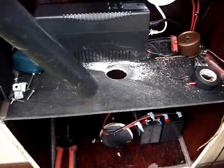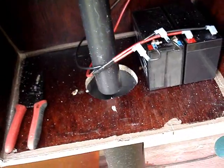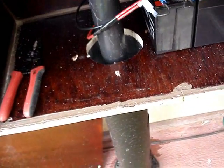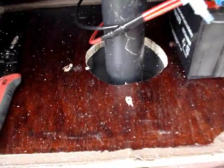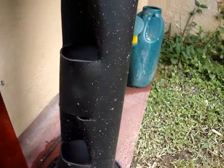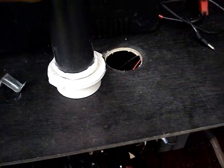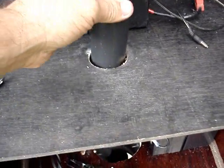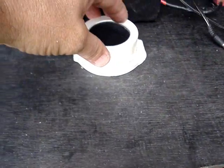I have to get fresh air up to the top portion of this box. The way I do that is I drop a 1.5-inch PVC pipe down through the floor into the top portion of the 4-inch vent pipe in the bottom that holds up the bottom of the box. I do that so it will draw fresh air up from the bottom through these vents. Gases lighter than air will collect at the top of the battery box, so I seal this pipe in so it will draw fresh, cool air up through this 4-inch pipe. The battery box is vented separately.